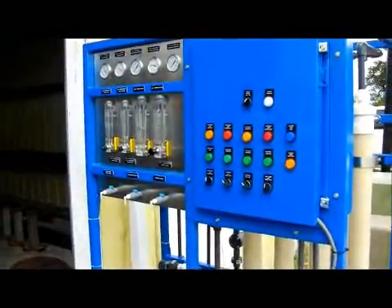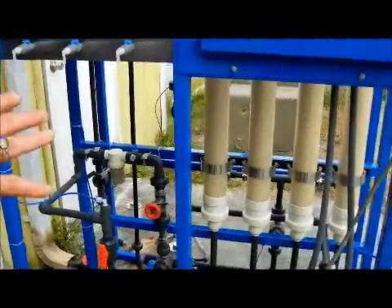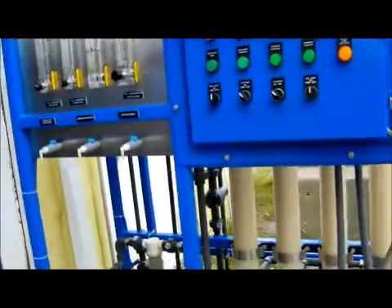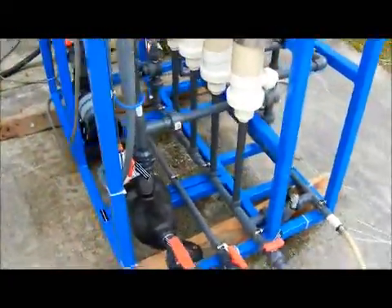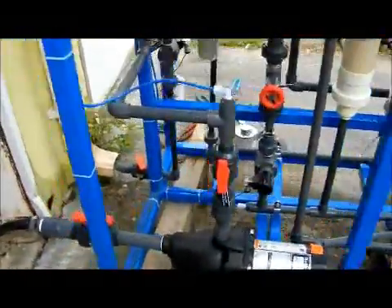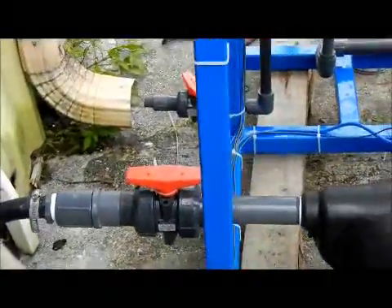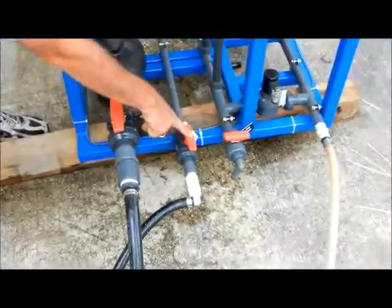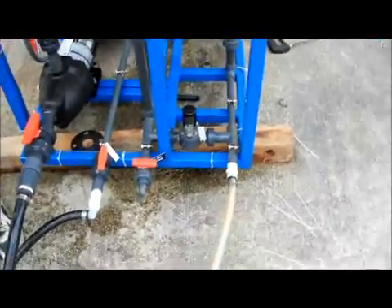From an operational point of view, you're going to adjust these valves. Once you get them adjusted, you can leave everything alone and let it run automatically. All the manual ball valves, as a rule, should be open — with the exception of this drain valve right here, which is for manually draining the system for maintenance purposes. That will take all the water out of the membranes themselves. All the raw water tank connections are on this side, and all the filtrate and drain connections are on this side — filtrate from the filtrate tank, filtrate out to your filtrate tank, your drain, and the main drain. Those are your four connections.